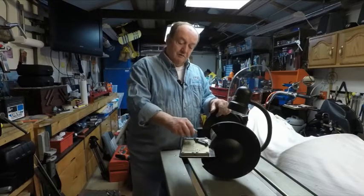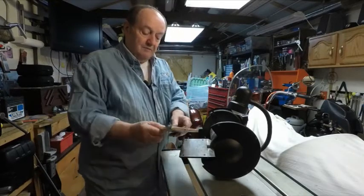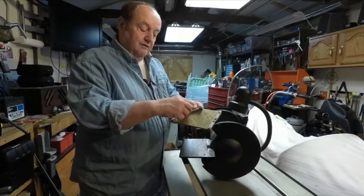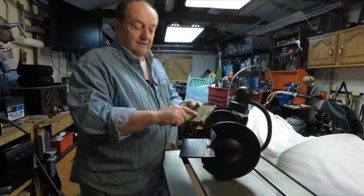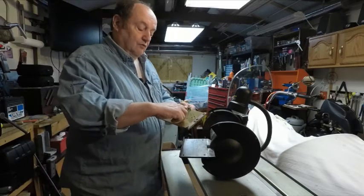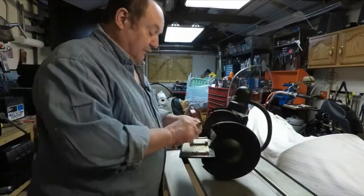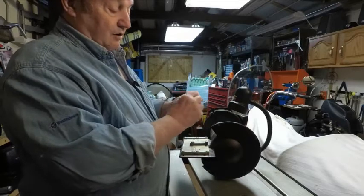So that's what I'm going to show. I wanted to use this same mechanism here that I made — it's two pieces of brass because I didn't have one big enough, and I put straps across. You unscrew the bottom piece, then the top one, and this swings back and forth. I have degrees on it — 30, 40, and 60 degree stops — and I can stop it on both sides to grind these tools. This tool has an angle on both sides: 40 degrees on one side and 30 degrees on the other. That's to cut from right to left, then it's the opposite to cut the other way.